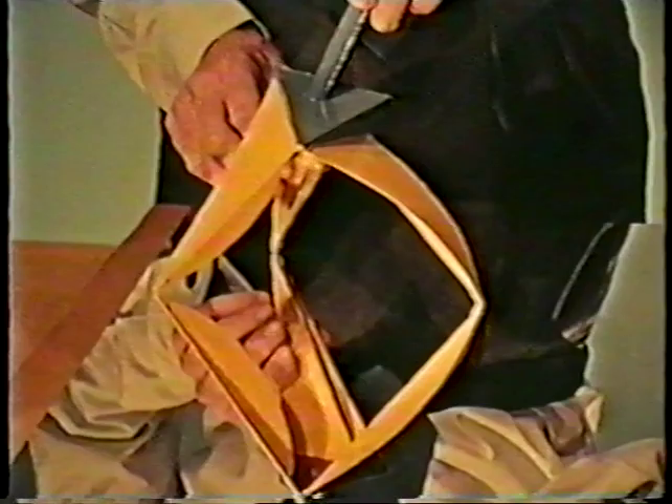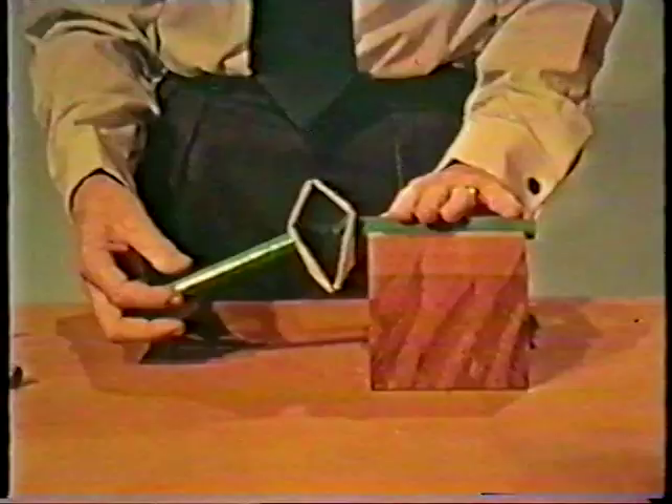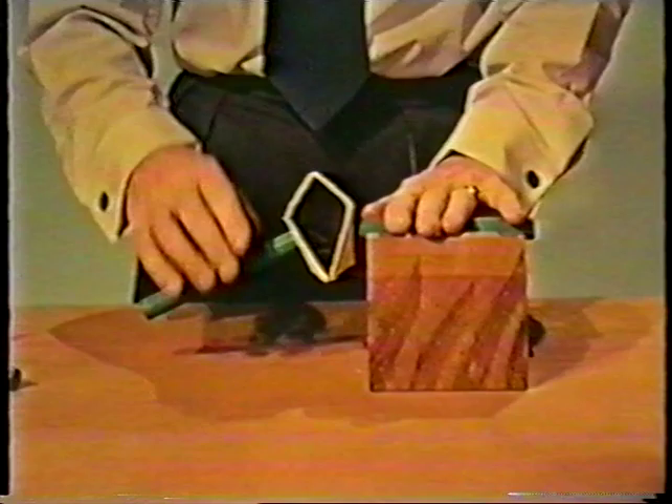The tripod may even be very distorted, but its reflection is always exactly symmetrical with it. And a deformed tripod like this, when joined to its reflection, creates a constant velocity shaft coupling. And here is one. The tripod legs are slightly crooked triangles, but the shafts always intersect at the geometrical centre of the coupling in the plane of the three tips of the triangles.